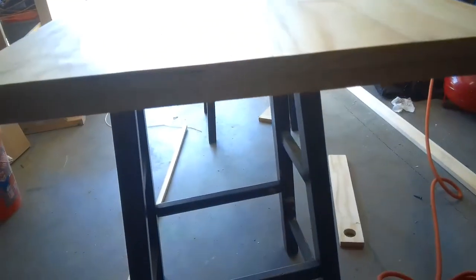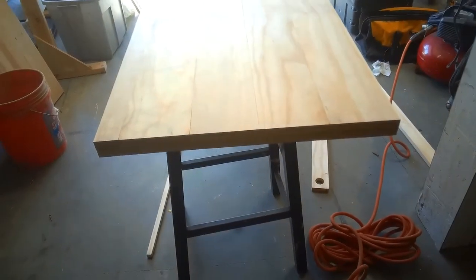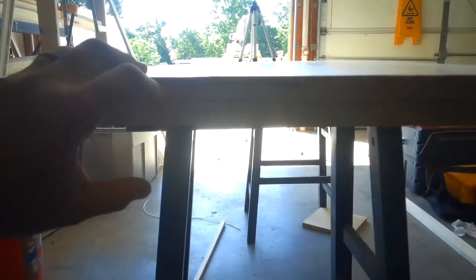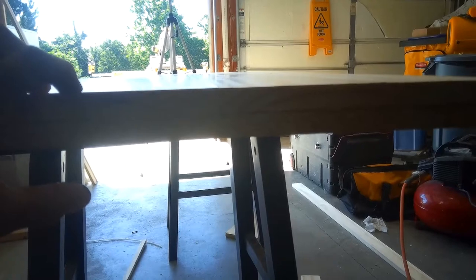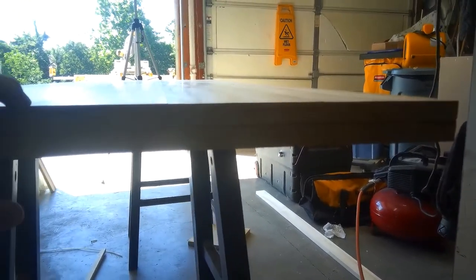So all the top pieces are in. There's just, like I said before, a little bit of lippage, but it's going to be able to be sanded out. You can see it's on top of the 3/4 inch particle board there, and that's 3/4 inch pine. What I'm going to do is flip this over and put another surround, 1.5 inch surround of the particle board for support, but also we want the countertop to look extra thick, so it's going to make it. So we're going to have like a 2.5 inch surround on this, make it look super thick.